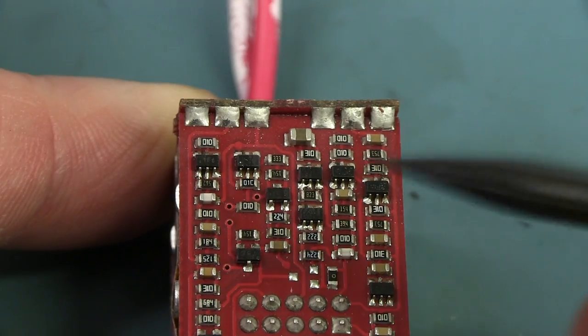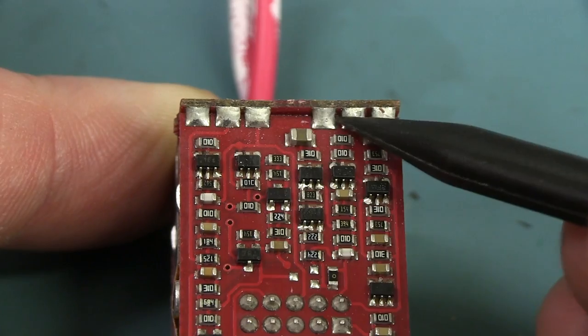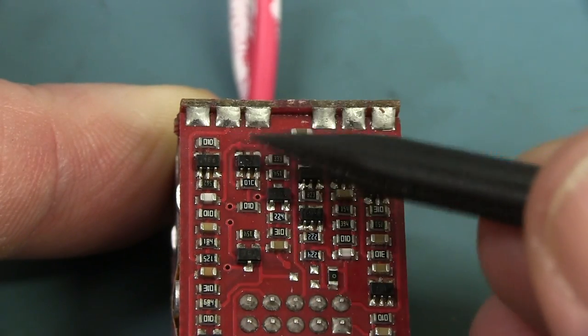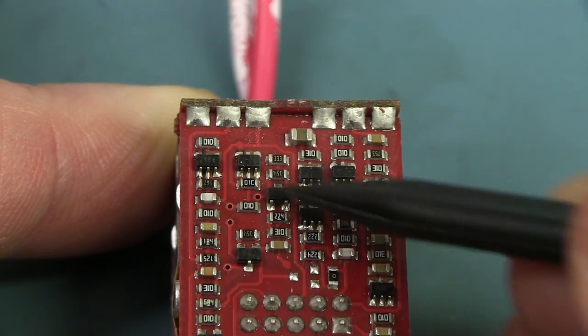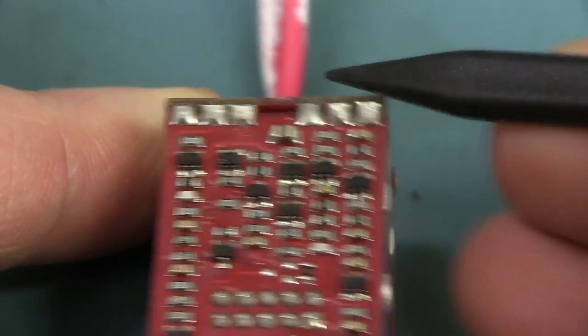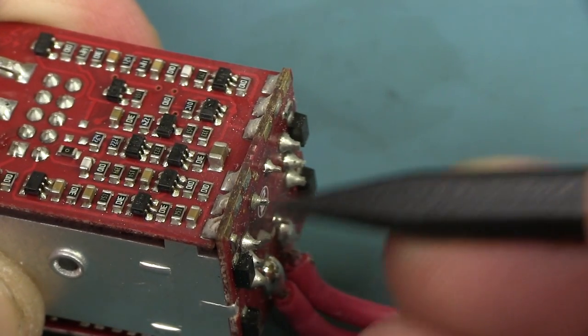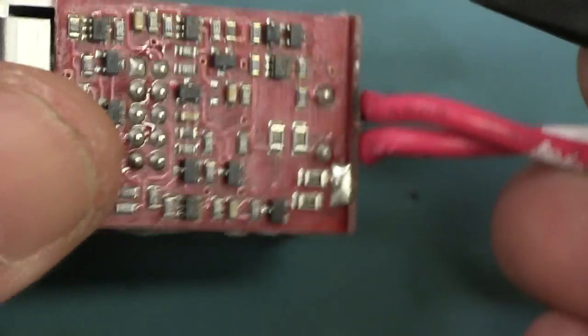And that's actually fairly common, to butt boards together in this configuration, like right angle boards. I've done that a few times myself, especially with slots. You can actually cut out slots inside a board and then mount another one at right angles like that and have the solder on both sides. You can get a pretty good right angle board sticking out of a main board there.